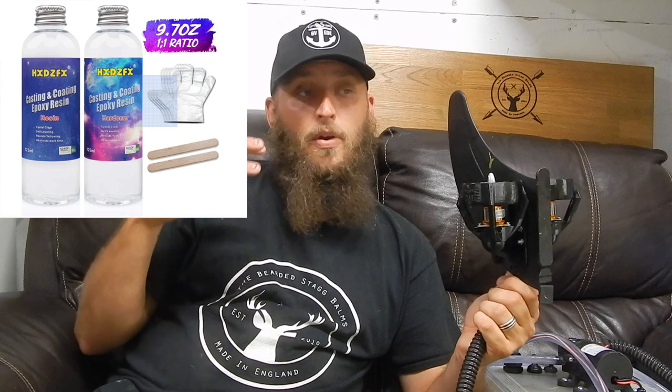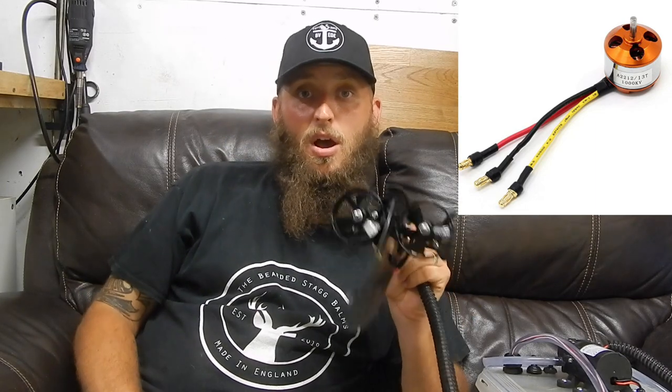I had a little issue with the propeller because they spin at such a colossal speed it was folding. I bought some two-part epoxy, mixed it together, and painted the propellers with it. Left them to dry for 24 hours — now they're hard as nails. All the others kept failing, but these are printed in PETG, really strong and hard, and I've had no issues with them whatsoever.